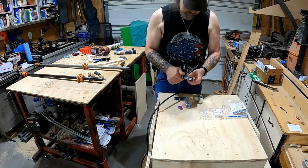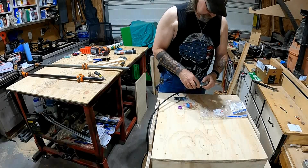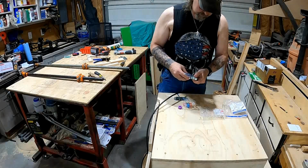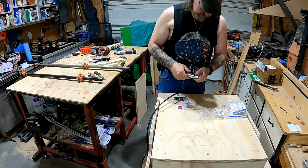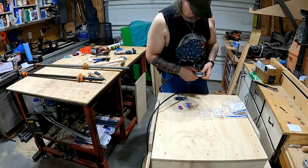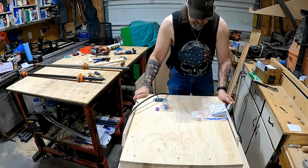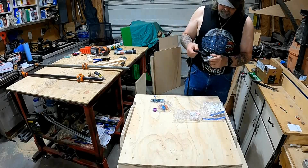So here I'm just putting together another CGB for the cord and a 1-inch coupling that's going to go on the threads on one side where the cord comes out. Again, it protects the jacket of the cord so it's not rubbing against the conduit or the black water pipe that everybody else uses. This is, in my opinion, the appropriate way to do your cord so you don't have to worry about it shorting out.